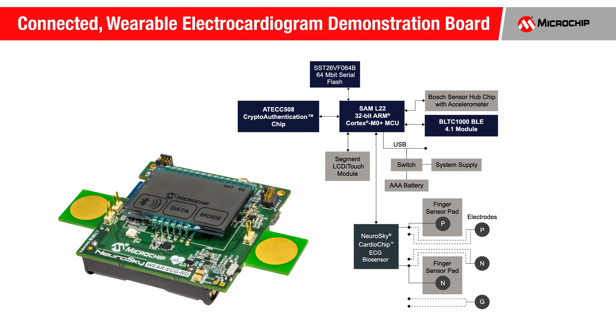This board can also be demonstrated using standard ECG leads. The BLE module can be used for smartphones and tablets with IoT capability. Patient movement can be tracked with this demo via an onboard accelerometer. This design shows how to achieve an overall lower bill of material cost due to its high level of integration. And finally, this demo is powered from a single AAA battery.